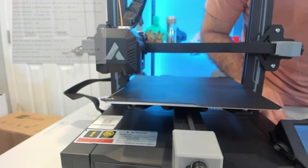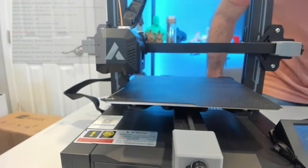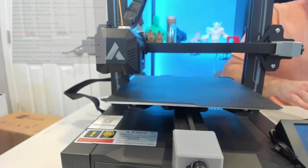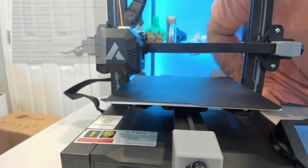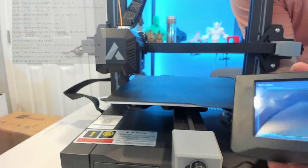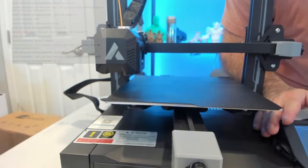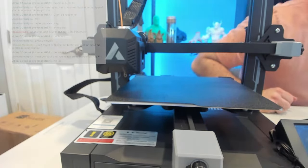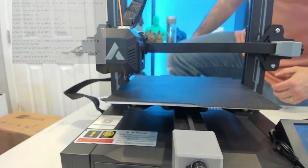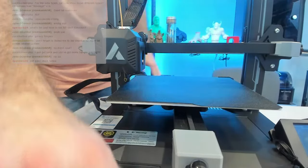I'm going to start a print again. I wish I did load a bed mesh now, John, because we're going to have to sit through that. It's my fault for not paying attention to the Z offset. I should have paid attention to it. Can I do an offset right now? I can baby step it right now if I wanted to. So there's a baby step menu for this 3D printer, which I'm in right now. And I'm going to do that as it starts printing. Yeah, I didn't notice. You know what, you can't really see based on where the camera is. I'm going to try and get the camera a little lower. I'm sure I'm boring everyone to death with this firmware image creation stuff, but it is fascinating to me. I love it.